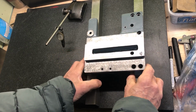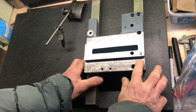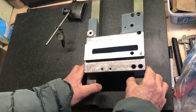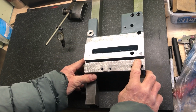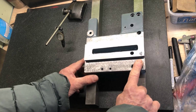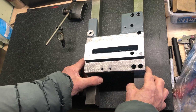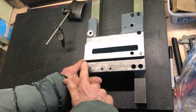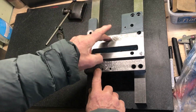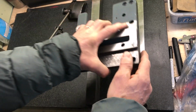And the usual wear then manifests itself by the front here being low. So of course, when you have the cross slide running over here, you will then have accelerated wear, mostly prominent here. This is true also on this saddle. It's not that much really, just minus 2 or 3 hundredths of a millimeter, so 1/1000th of an inch approximately. And the rest here and here is quite flat. Although this side here is on the low side, but I think that is just these planes here which are not to be trusted.